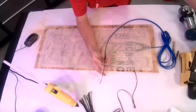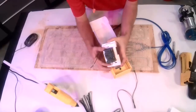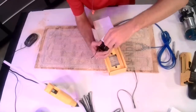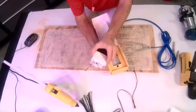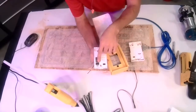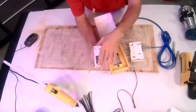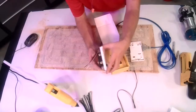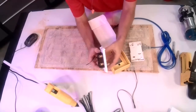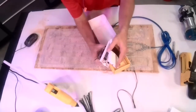One thing I did forget to mention, these thermostats do just fit inside a standard junction box. So if you remove the front cover, you've got a little hole, and that's where your 2 little wires from your temperature sensor go, which have no polarity. They can be connected either way. And then you've got 2 screws, which screw in just like a light switch or a regular outlet into a single junction box. So pretty straightforward on that end.